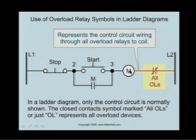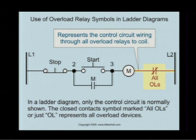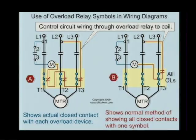Other than the manual starter that we showed and talked about earlier, the overload is going to be the only thing that you put on the load or the line 2 side of the coil. Other than a manual starter, on the line 2 side is going to be the overloads, but that's already built into the contactor, right? The line 2 is connected, and the overloads are already wired. So let me go back to this picture here. This line 2 connection through the overloads to this side of the coil, that's taken care of.